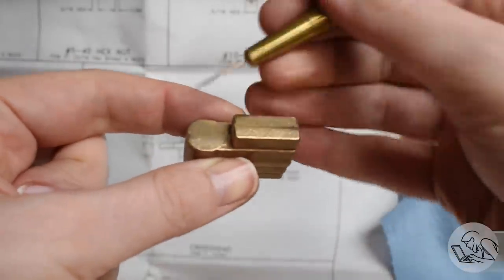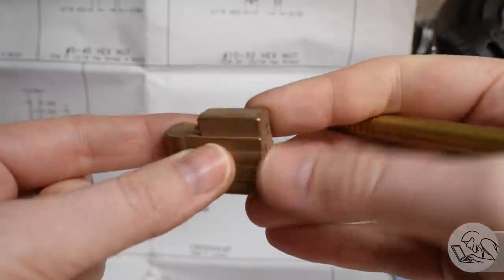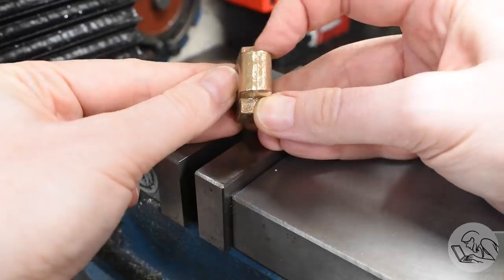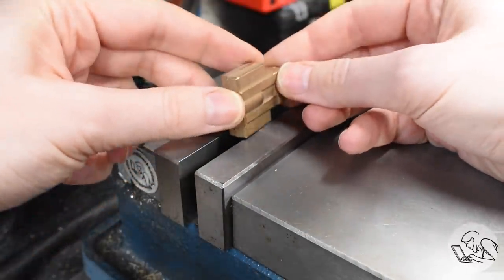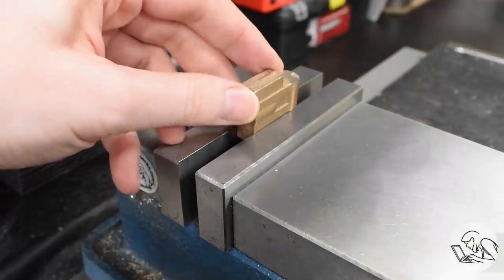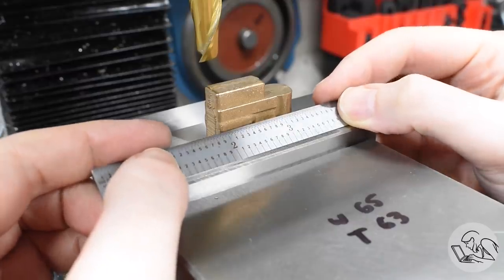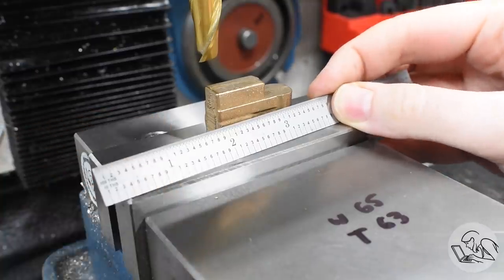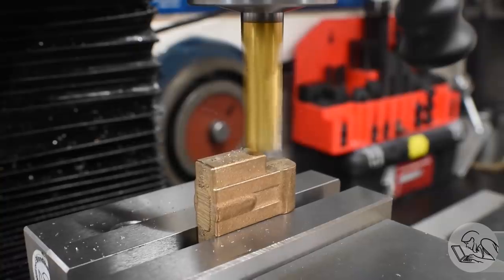There are no references on this thing yet, so let's see what we can do about that. This casting has a little bit of an offset in the round section, so I need to be mindful of that and work around it. I'm going to grip one leg of the crosshead just like so - this will make sense in a moment. I want to make sure I'm level with the cast details so that the casting looks straight when we're done, and I'll start by cleaning up the top of one leg.